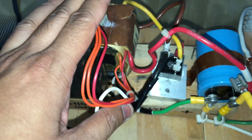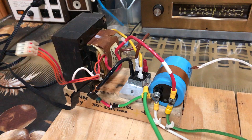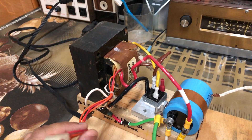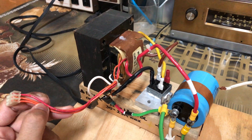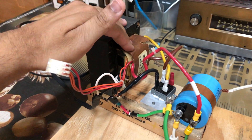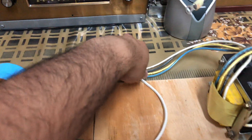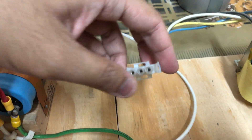As I mentioned before, a lot of UPS transformers have a second set of 15 volt AC windings along with the primary winding side — usually it's a tap from that. In this one it's easier to understand, but in this particular transformer it can be a bit confusing.